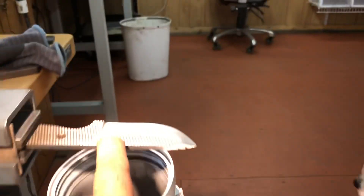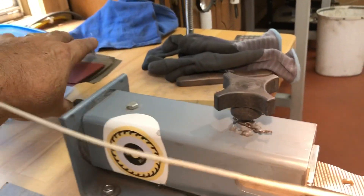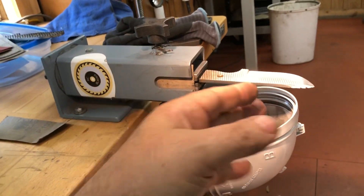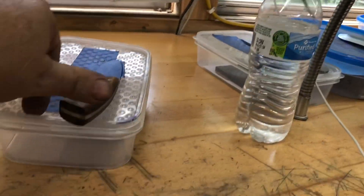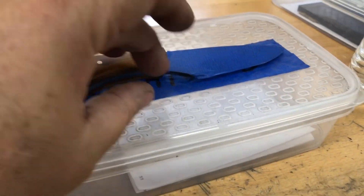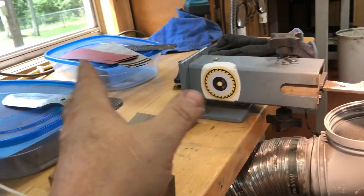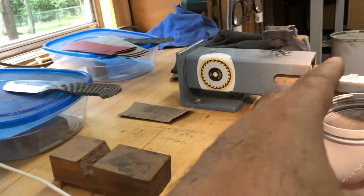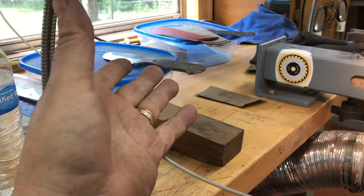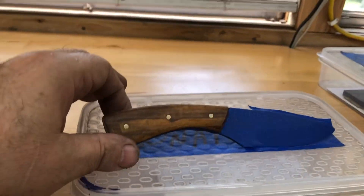I have this sanded up to 150 and I'm bringing it along with these — the others are sanded up to 400 and I'm starting on 500. I'm gonna get this one up to that point and bring it along with the three knives. I may work on this one tomorrow because at this point I really have to concentrate on it. If I get these all up to 500 and then 600 today, they'll be ready for 800, then buff, then heat treat. After heat treat I'll start over cleaning them up with a wire wheel.